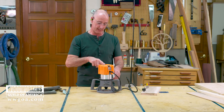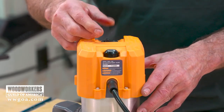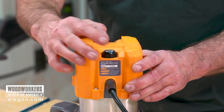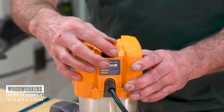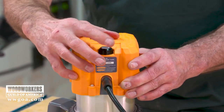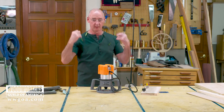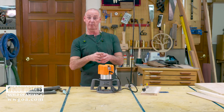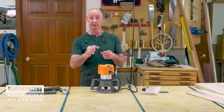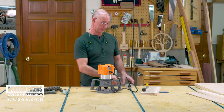So here's what we've got. On switch, and then basically like a dimmer dial here, like you'd have on a light, and you'll hear the speed ramp up and down. So again, you've got to remember, large diameter bit, lower RPM. Look at the speed chart that we've given you in the description that goes with the video. You've got to follow the rules of the road on that speed chart.